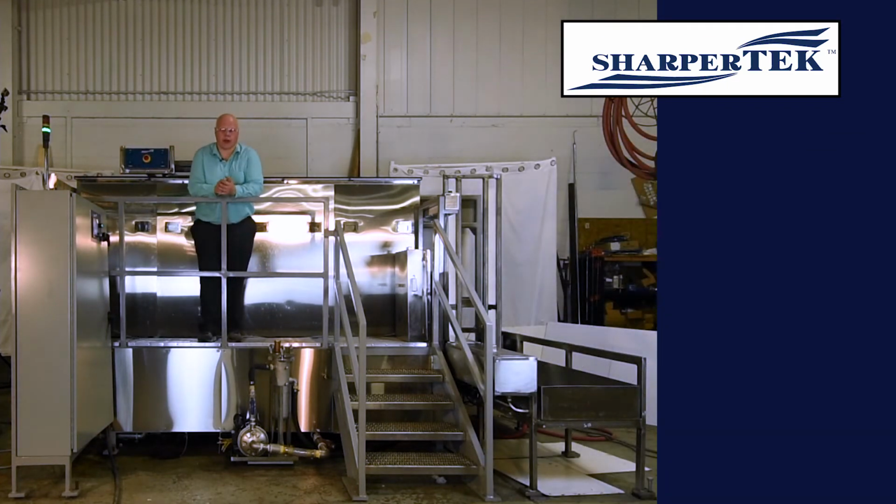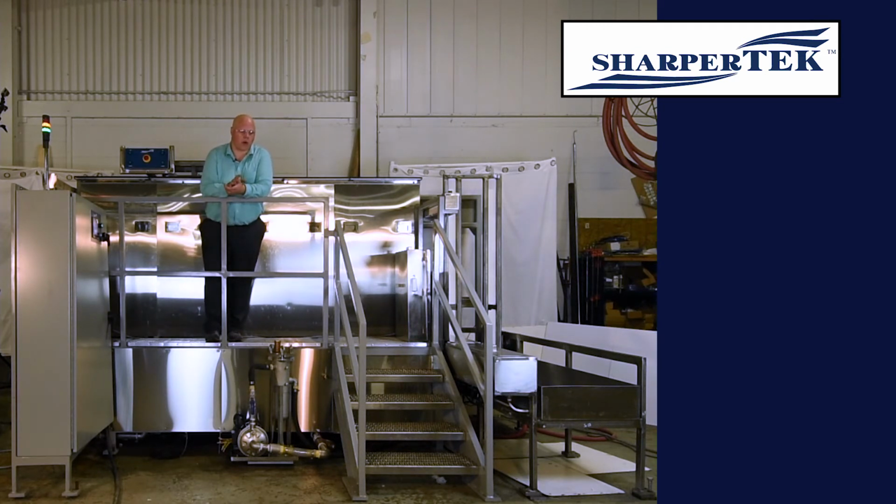So this unit is designed to clean to a certain mil spec. This one can, in the load station, use hot soapy water to clean a cylindrical or rectangular part that's long and heavy. This is made for a 200-pound load, and we can take it from a horizontal working area into a vertical orientation so that we can move it along in our wash process.